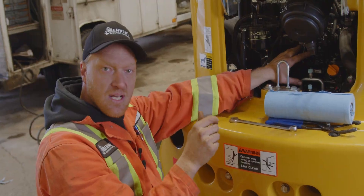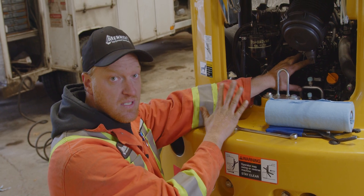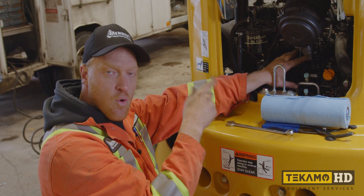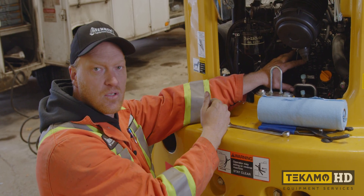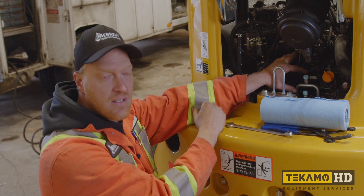We're going to just bump it over a couple of times - on, off, on, off with the key - just in case there is water in there. Right now I'm still flabbergasted no water came out. After we do that a few times we can start to turn it over more, then hold the starter over and let it turn over. If any water is in those holes it's going to push out through the glow plug holes.